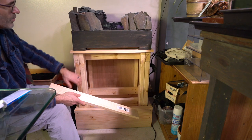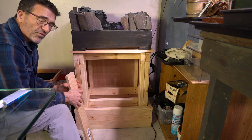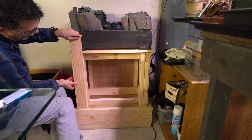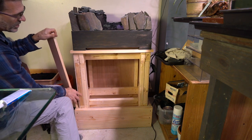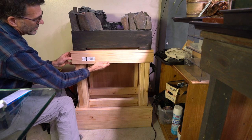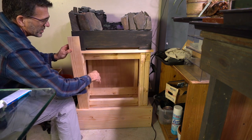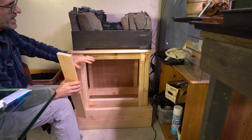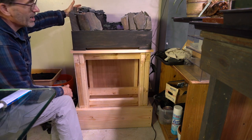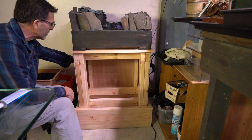Really super strong. I've got one-quarter-inch plywood on the sides and the back — nothing in the front because we're going to make a door. So we have our trim here to give it a little bit of a decorative edging. This will be the lip right here. I'll get some straight wood and make it work, and then I'll probably put this on hinges so I could put a cover on here. The reason we want it to open is because back in the corner there's going to be an area where we can slide the bubbler and all the cords for the power.